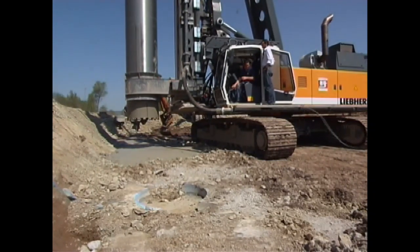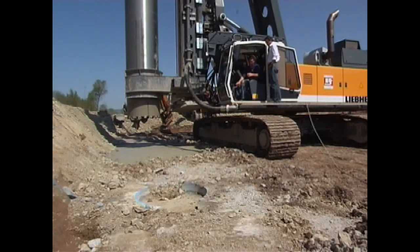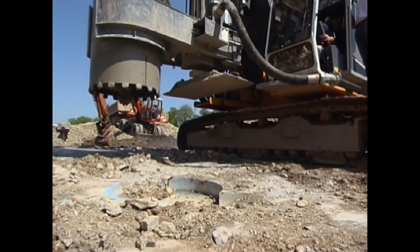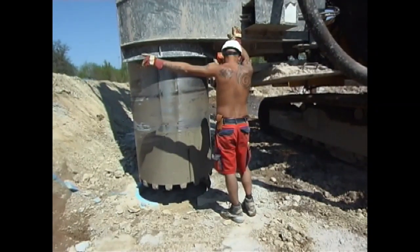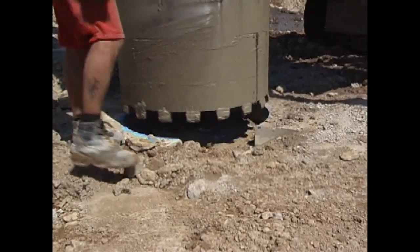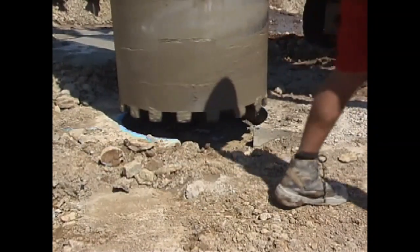The company performing the work optimized the stiffness and forming of the drilled pile wall and selected a drill diameter of 1,090 millimeters for the piles. Thanks to the double rotary procedure, the casing and drill tools could be adjusted to this required pile diameter.